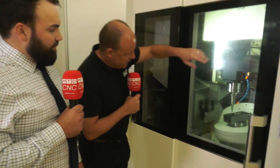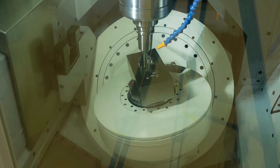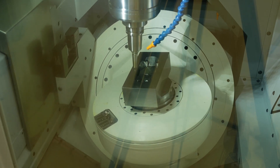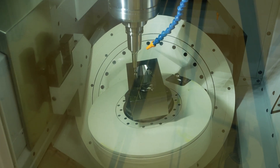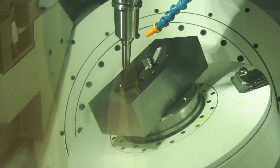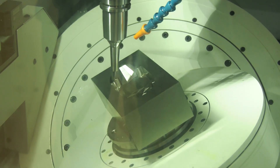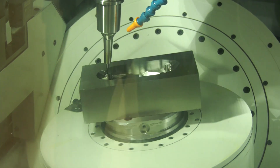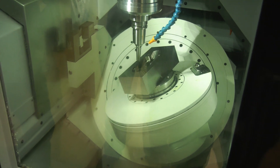When we look in here, this is what they call a closed bridge — the best configuration for machining to really tight tolerances. The centre point of the part is always remaining in a consistent position. It's all about the table design on the Makino — keeping the part and the weight of the part around the centre line, the centre point. The movements are very smooth, the table is very agile, and the direct drive motors all add up to a really stable platform to machine on.